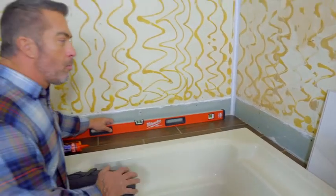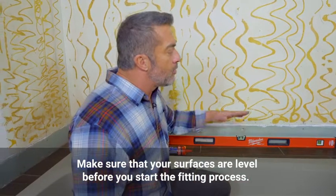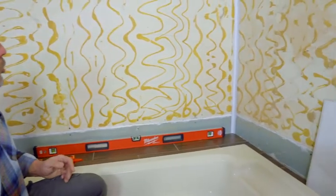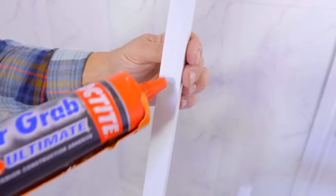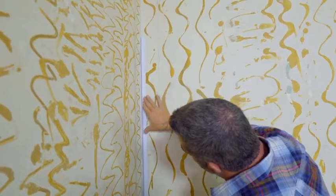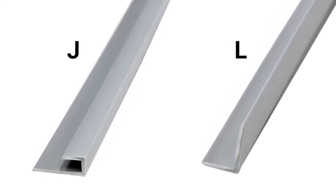Like in any installation, you want to make sure you have plumb walls and level surfaces to tile on. Check for level — if anything is not level, you may need to trim the first course of tiles to compensate for that. Now let's talk about the corners. You can install the tiles into the corners with a trim or without a trim. They make an inside and outside corner trim available. If you choose to use them, install them firmly to the wall by applying the Loctite PowerGrab adhesive to the back of the trim and pressing firmly. DumaWall makes inside and outside corner trims as well as J and L trims that can terminate the edge of the DumaWall tile.